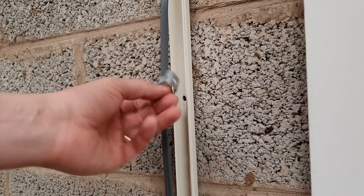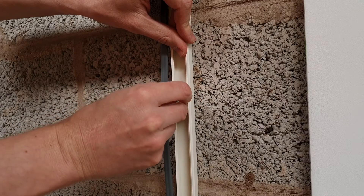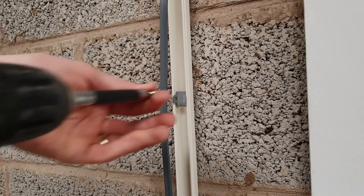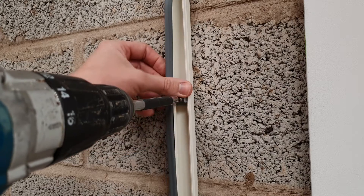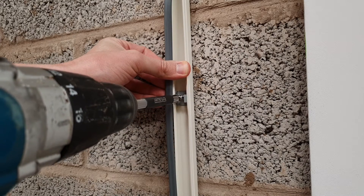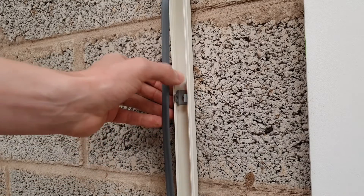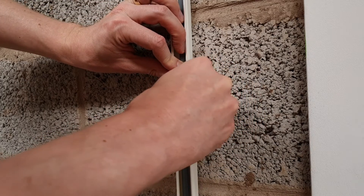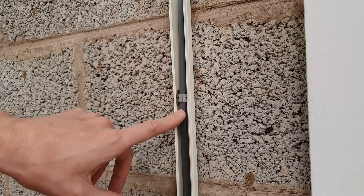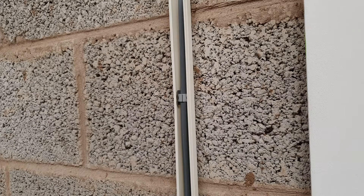The first fixing we're installing into the trunking is the Cable Safe clip from Illumino Ignis. We slip it into the back of the trunking — it's a nice snug fit and doesn't slide down once installed. Then I get my DeWalt Wall Dog and screw it in through the pre-drilled 5mm hole — it bites really nicely and tightly into the wall. It's then simply a matter of popping the cable inside and folding the little tabs over to hold the cable in place.